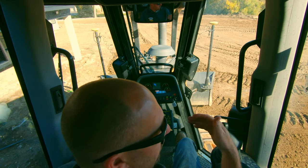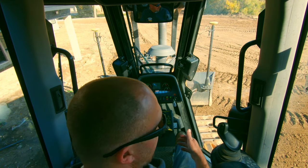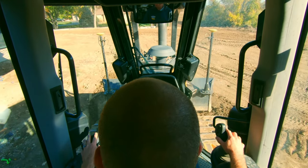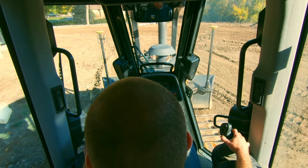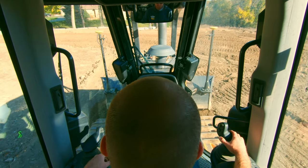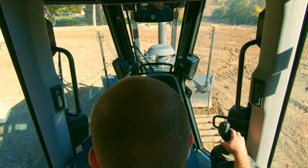I want to be very forward with you: when you get in a dozer for the first time, you're going to spend the majority of the day frustrated. Take it slow. Dozing is not about being the fastest guy out there. When you get good, speed comes — but when you're first learning, there is nothing wrong with going at a very slow pace. That's a perfectly acceptable speed for your first day. You've got lots of time to adjust and get everything dialed in without blowing something out because you're screaming along. If you make a mistake, you can just come back and reset.